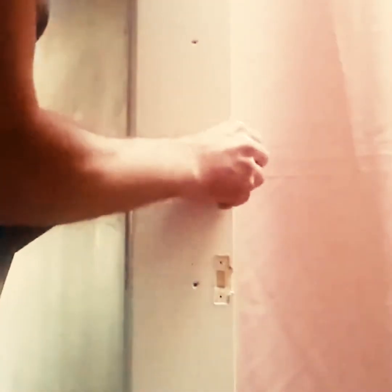I mean, these could have been marked out with a marking gauge. I just chose to use a combination square this time. It was to hand. And just neatly go to the lines. It doesn't want to be too snug, because you are going to paint this afterwards, but you want it a reasonable fit, and it shouldn't look messy. It should be clean and crisp to the edge.